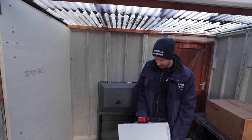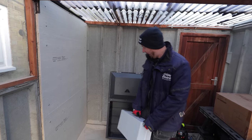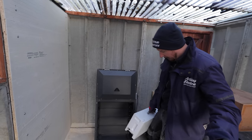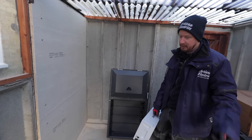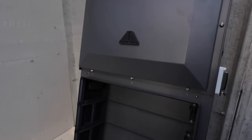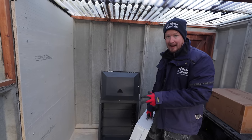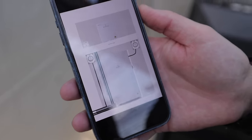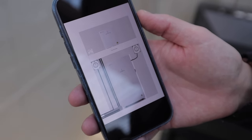This is a battery — I know it looks like a suitcase, but it's actually a 3.3 kilowatt hour battery module. This all-in-one battery system allows you to slot four of these into it. It comes with four, so it's a total of 13.5 kilowatt hours of battery storage. But they're so heavy that you'd never be able to get it on the wall fully loaded, so we've taken the battery modules out. We're marking up our nice flat, smooth, fireproof surface so we can get it all laid out neatly, and I've made a diagram of how we're going to lay everything out — plan ahead for a neater install.